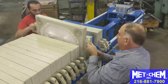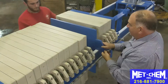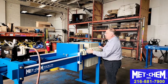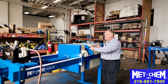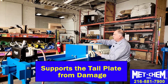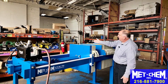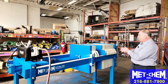You can move the tail plate up in the stack, making the effective filter press smaller by using fewer plates — whatever you decide is necessary — as long as you put it in the right place maintaining the one-three-one-three button sequence. Once you move it, the unused intermediate plates behind it are recessed and won't fully support the back of the tail plate, so this steel pusher plate provides that support. Put it in and it goes up against the flat back of the tail plate; the unused intermediates go behind it, then apply the closing force.